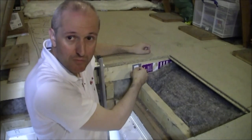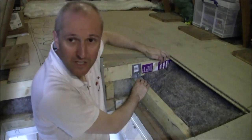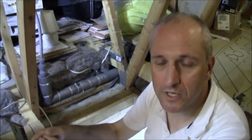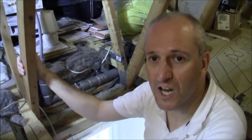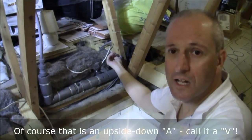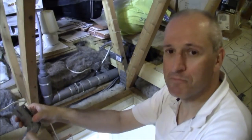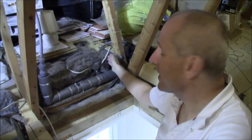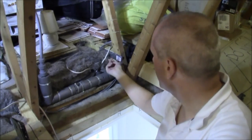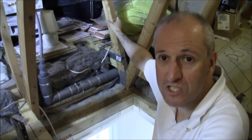For reference, this is a 47mm by 100mm joist, 2.4 metres long. The secondary way it's been secured is to the A-frame — that's the A-frame structure in the attic of most non-flat roofs. There's a fixing bracket that's long and flat rather than L-shaped, and we lined up the over-joisting with the A-frame and put three holes and three screws along there, making it very rigid and attached to both the A-frame and the original joists.